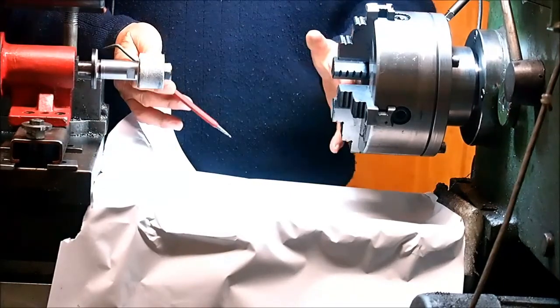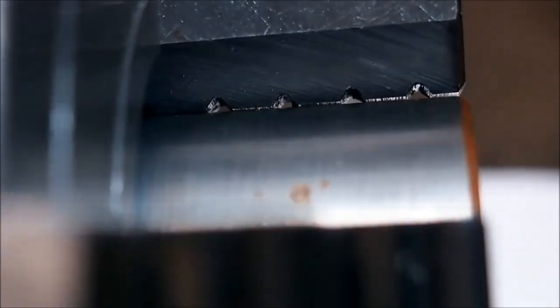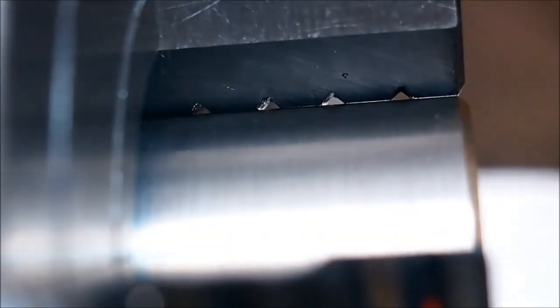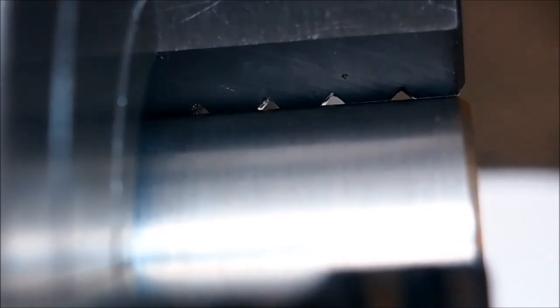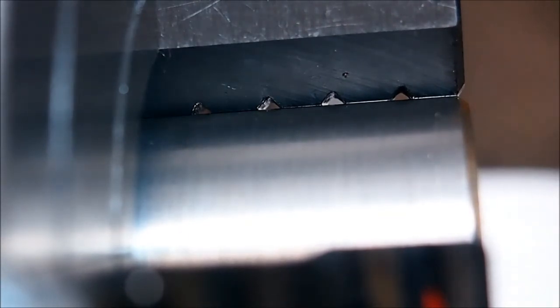So let's get started and I'll show you how we went about it. I mentioned before that I can actually see daylight through here, and I've got this piece cinched up snug. You can actually see daylight under the jaws. I'll just grab a feeler gauge. There's a five thou feeler gauge — I can't get five thou under that one. But I can see daylight under that one. Try a one thou — yes, I can just get one thou under that one. That's jaw number three.